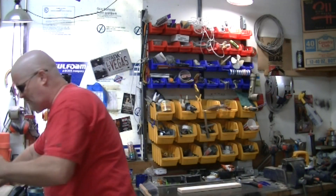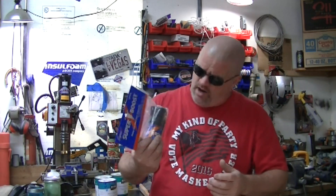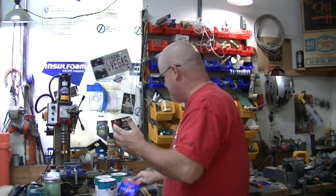I made this video because I looked at a lot of videos before I bought my generator. There are a lot of people asking if the 3500 Predator will run an RV's air conditioner. I have a Tahoe, 30 to 31 foot RV, and it's got a 13,000 BTU air conditioner on top. It does not have booster caps — I did buy one, still right here in the bag. I'm probably going to put it on because I think it does help the system start up, makes it easier.